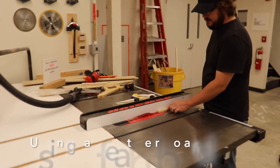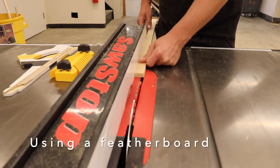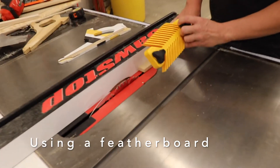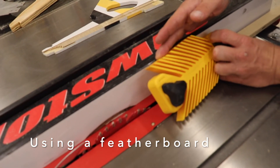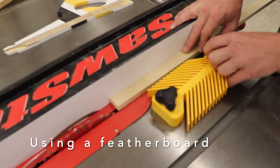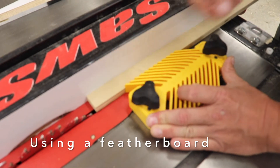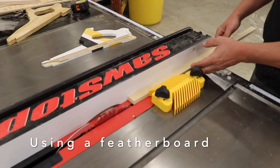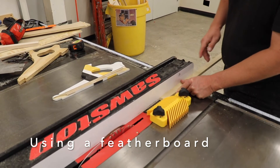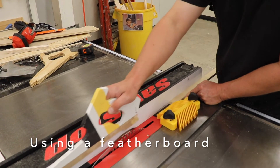When making a long straight cut, I'm pushing down with my finger and pushing over against the fence. If you need a high degree of precision or assistance maintaining that pressure against the fence, use a feather board. Insert the feather board so that material pushes through but there's resistance keeping it from going backwards. Press the feather board against the material and turn the magnetic switches 90 degrees to the right to lock them in. Now there's tension holding the board against the fence. Continue to guide with your left hand and use a push stick to maintain downward pressure and carry the cut all the way through.